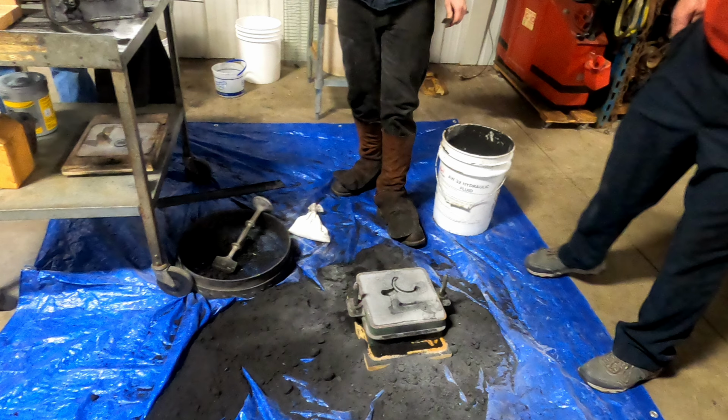Brass shrinks about 8 thousandths per inch up to 17 thousandths per inch based on alloy. Aluminum is somewhere between the 10 and 15 range. Again, it's alloy and geometry specific. If I had a giant transfer case cover where it's got that big hump in the middle, that sand's gonna prevent it from shrinking because it's hard sand. But if I have a really flat part, just like a bar, there's nothing to hold it up to prevent it from shrinking, so it's just gonna pull itself in.